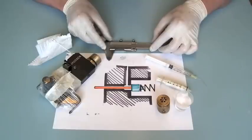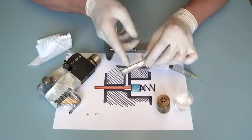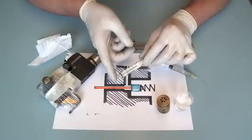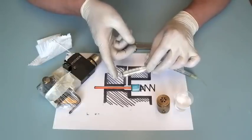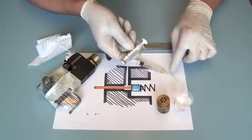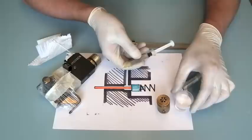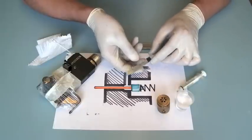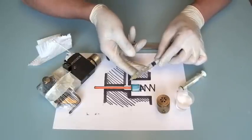The other way of doing it, which is slightly more precise, is simply to get a syringe marked in cc. You can get these off eBay, a DIY pharmacy, drugstore, vets, or places that sell ink cartridges for your PC printer. Get one with a blunt needle if you can. All you do is use water — you could use very thin silicone oil, but water gets into all the nooks and crannies because it's not too thick — and fill the outlet valve chamber with the water and measure the cc.